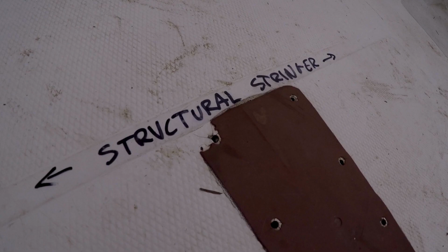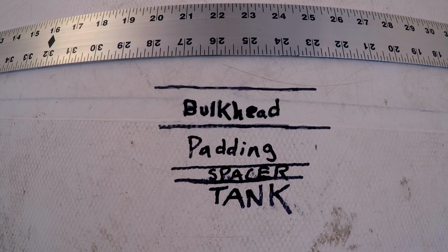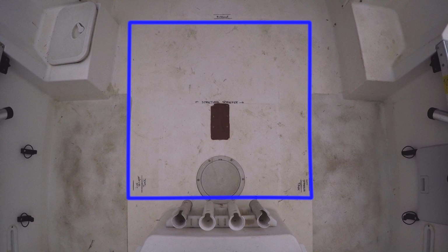With a 30-degree miter, reinforced resin, tabbing, and multiple layers of 1708, the deck will be stronger than ever. As for the rear tank issue, I hope not to cut into the engine well. But these old rod holders have to go. Notice how Bayliner left a smooth area over the bulkhead at the factory. In order to maintain a 4-inch tab, here is where I'll have to cut, but it doesn't leave much room for the tank to lift out.